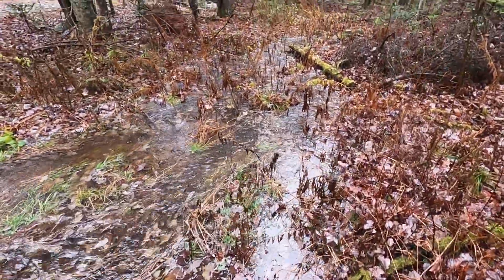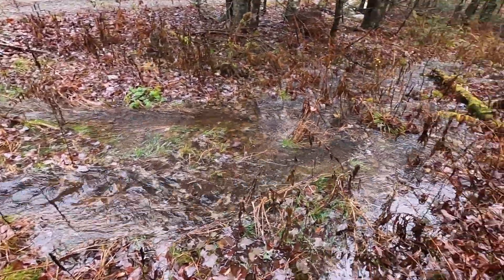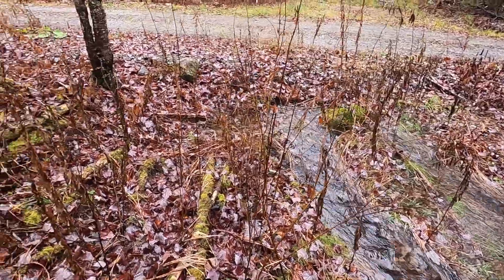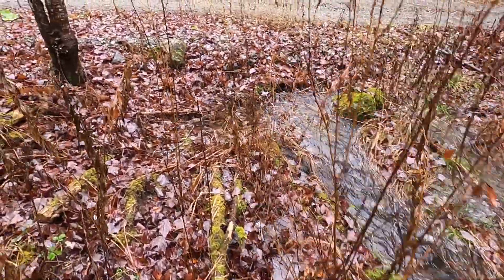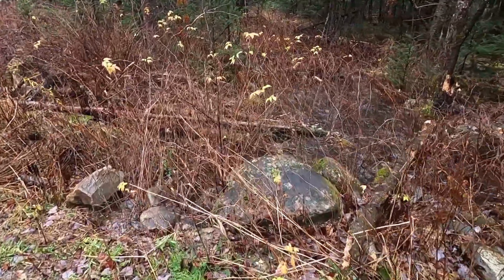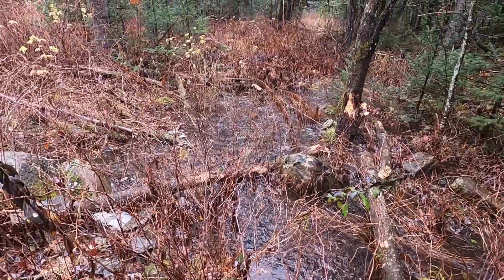This was actually one of my first drainage projects when I made this initial road into the woods. This area almost always has some flow — a little bit of drainage from a swamp or wet area up above. There are no culverts here. This was sort of a natural culvert made of larger stones. All I did was put fabric over it and gravel over it, and for the most part it'll handle any water coming from upstream unless we have a rainstorm.